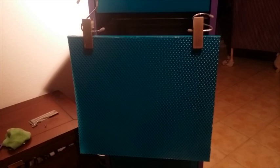Moving right along to our next step. Here I have the panels attached to the front of the drawer with a metal clip. This is going to help me as I make holes through the plastic so I can reattach the hardware that I took off earlier. I started out using a marker to mark the back of the panel, but in the process I decided to just use the hot knife so I can melt right through it without even taking the panel off — so I didn't even need the marker. Hot knife: just pierce right through the plastic and wiggle the knife back and forth to make the hole as wide as needed so the hardware fits in nice and easy.